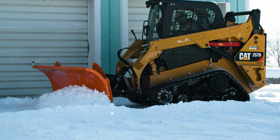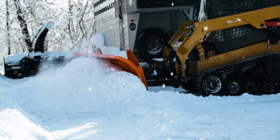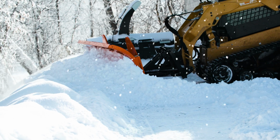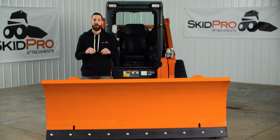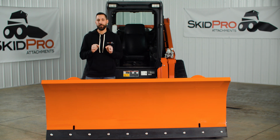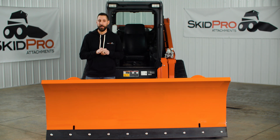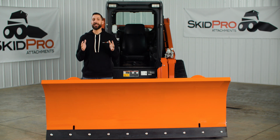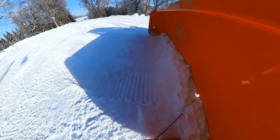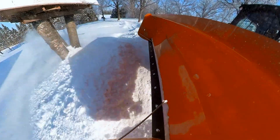The fully gusseted moldboard we already know is tough, but tough alone doesn't always mean functional. Our engineers found that a 34-inch height and 40 inches of total curve cold rolled steel maximizes snow moving volume while maintaining enough visibility to accomplish your job safely and efficiently. The moldboard has a few degrees of built-in oscillation, granting the blade the ability to follow the contour of the ground with only moderate down pressure. This is a critical, though often overlooked aspect.